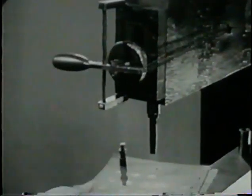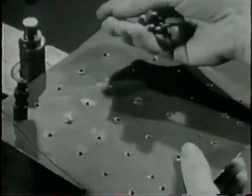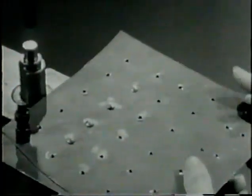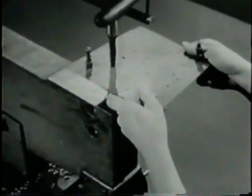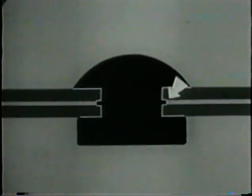Lift the upper arm to remove the scrap. To test the setup, insert a few rivets. Locate the rivet head in the rivet set and hold the material tightly together. If the parts aren't held firmly together, the rivets will swell between the parts, like this. Here's how they should look.